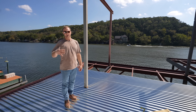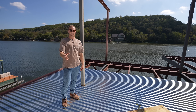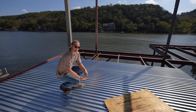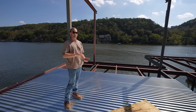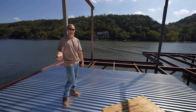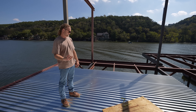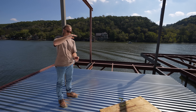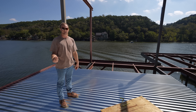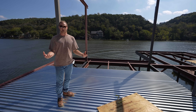Before coming to Revent, I used to work in a commercial setting and we used metal pan decks a lot. There are some fun — or not so fun — things about metal pan deck in Austin. Right now this stuff is pretty warm to the touch, but in the middle of summer it would be baking anything put on it. Often what we would do is come out the night before or in the morning before a placement and hose this down with water to keep the surface from overheating. If it overheats, it can take your concrete and bake it from the bottom, curing it too fast or causing cracks, which you don't want. It's just really cool to see such robust systems used on a home.